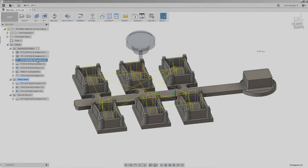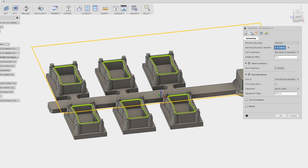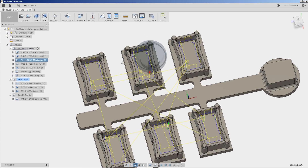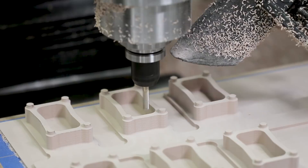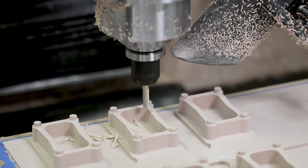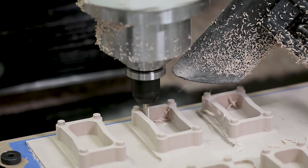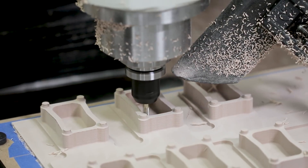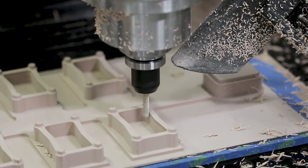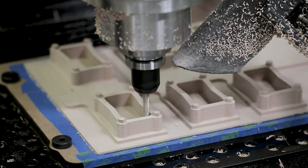One more 3D adaptive — this is with our tool 31, a quarter-inch three-flute end mill, with rest machining checked. Really all this is doing is cleaning up the inside corners of the casting part. In the end, I don't think this was necessary. My thought was to reduce those corner materials to ensure a really consistent tool pressure during our surfacing pass later to maintain the best surface finishes. If this were aluminum or steel with more tool pressure, I think it was a wise move, but here we could have gotten away without it.